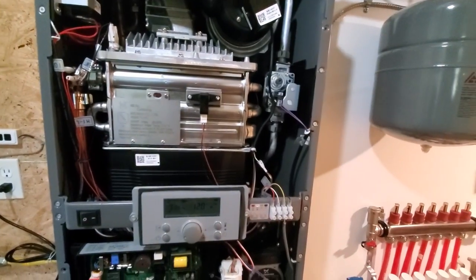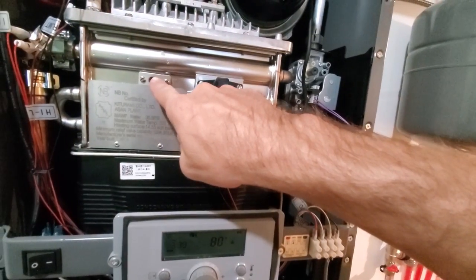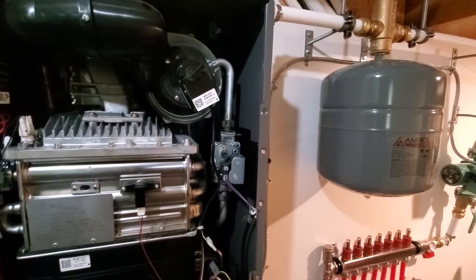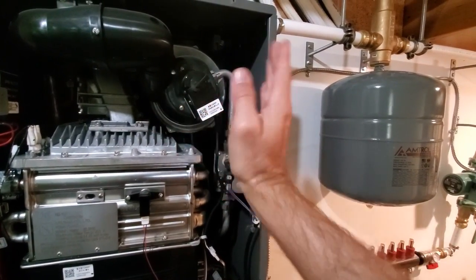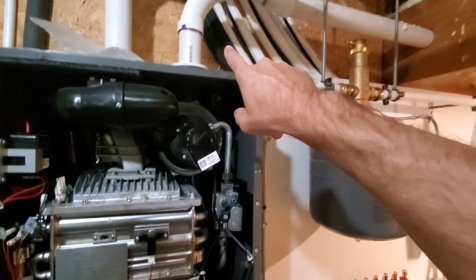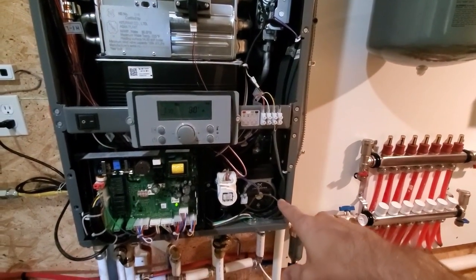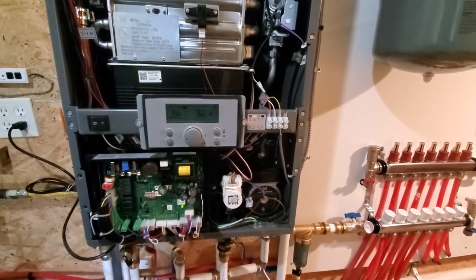So now they just turn the hot water off, it senses that there is no more water flow, and it shuts the heater off, and it also shuts the vent to the air intake. Inside this unit is a valve that's opening and closing, which determines which direction the air is flowing, whether it's coming in from my intake or out through the exhaust. When I set up the system, this should run for 3 minutes. The reason it does that is to make sure it cools the system down so it doesn't overheat.